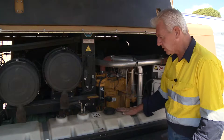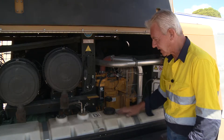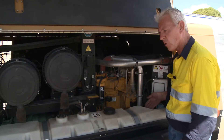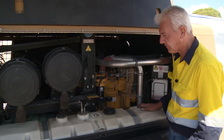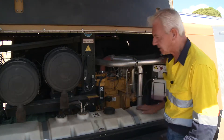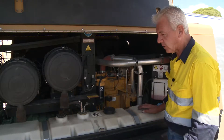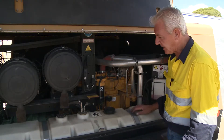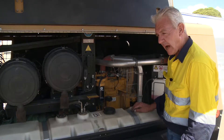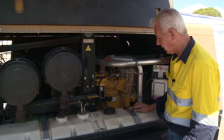What I need to check here is the fuel. Because it's a translucent tank, I can see how much fuel is in there without even taking the cap off — I get an indication just by looking at the wall of the tank. This particular machine will also tell you how much fuel is in it. It also has a low fuel cutout, so if it runs too low it'll cut out before it actually runs out of fuel, so you're not starving the pump and injectors, which would cause another problem.